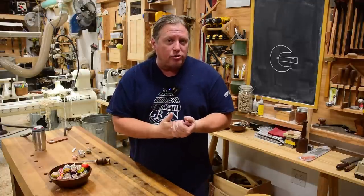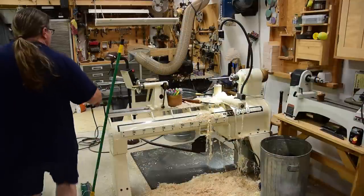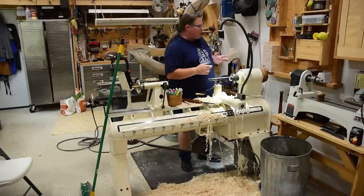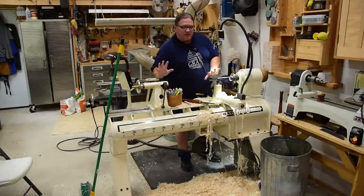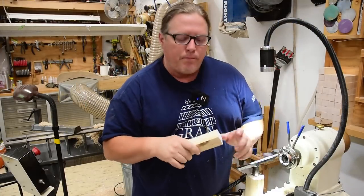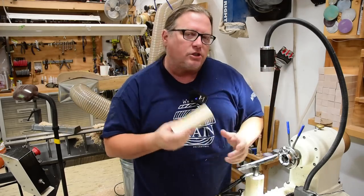My processing is to eliminate time as much as possible. It dictates what tools I use and how I use them, because I'd like to get my timing down low enough to wholesale these. I will admit I'm not there yet, but I'm continually refining it. I do use a full-size lathe, but you can do this on a mini lathe. For material, I use 6-quarter hard maple — from the sawmill, making squares out of large boards. It's the cheapest way to get it. You do want hard maple, not soft maple — the harder the wood, the better the finish off the tool.